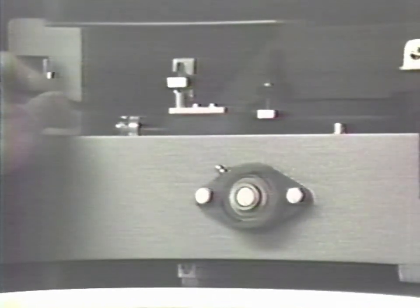Having made the adjustment on the chain bearing, it is necessary then to readjust one of the balancing weights in order to bring the balance back into equilibrium. Having done that, and perhaps trying more than once, we can recheck the calibration by again returning the chain to read zero with the pan empty, release the beam, make sure the pointer is reading zero.